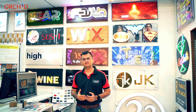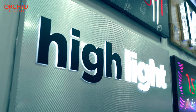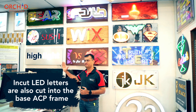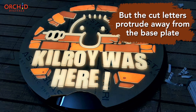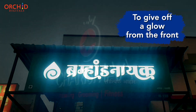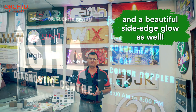One step away from our stencil boards is the incut LED acrylic boards. Here, the letters are not really 3D — we have cut the letters from the base ACP. But instead of placing the acrylic face in line with the base ACP, what we have done is we have pulled the acrylic slightly ahead, sort of 5–8mm in the front. This gives us a very nice look for our board.